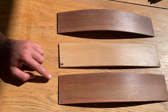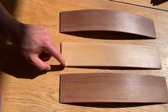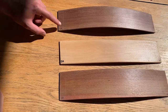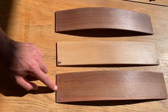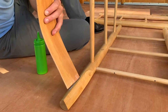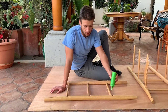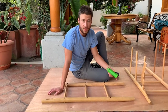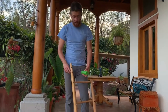The arrow always has to be facing up towards the sky. There are also some faint lines to give you an idea of where the slat is within the chair — as soon as the line meets the outside of the leg, you know the slat is all the way inside the hole. Next, put glue inside each of the three holes in the back and front of the left side of the chair or stool, and don't forget the slot on the other side as well as the holes.